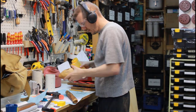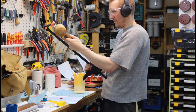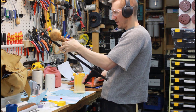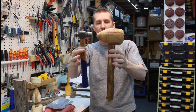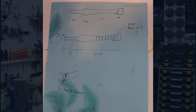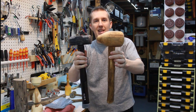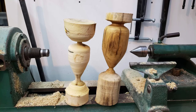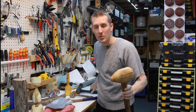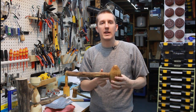As far as size, a run-of-the-mill average bossing mallet has a three-inch diameter head on the larger side, about five and a half inches long, and a handle typically about 10 to 12 inches. Compared to a typical hammer, it's much bigger. This one is probably a little on the larger side for metalworking — it's actually closer to my small sledgehammer in head size and handle size, which is meant for pounding stakes. So it doesn't have to be this big. These two actually weigh about the same. It just has to be functional with the right balance and right weight for metalworking.